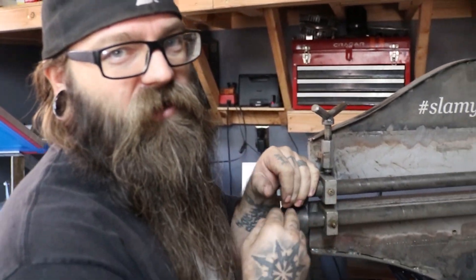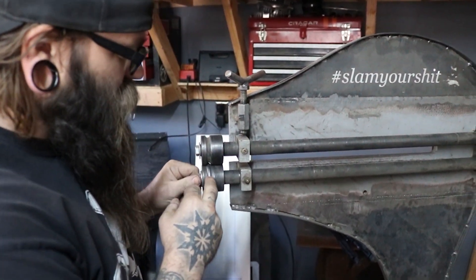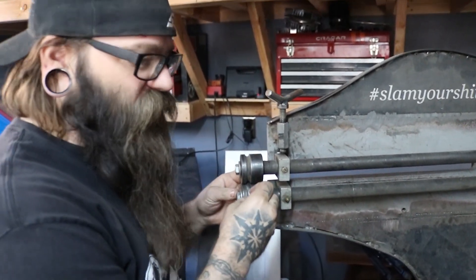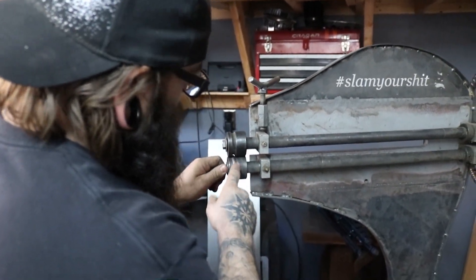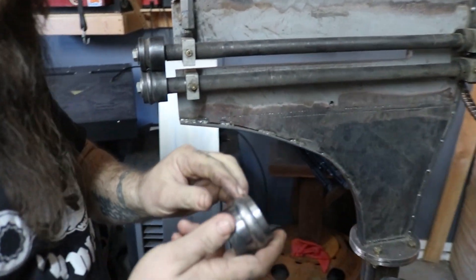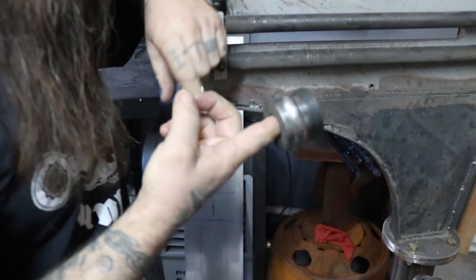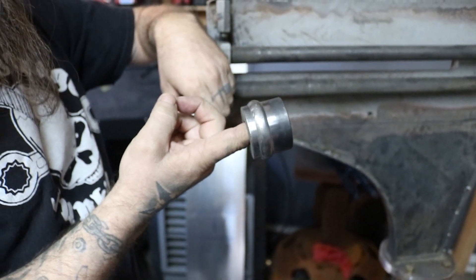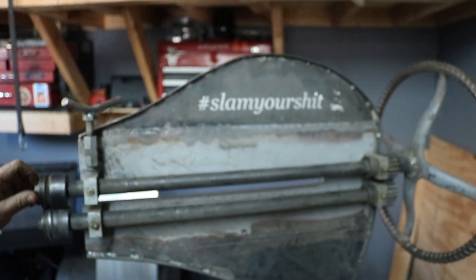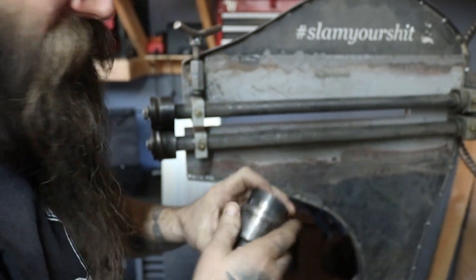I lied when I said I've never used this. I've actually used this to do intercooler piping on a Subaru — I used this to roll the aluminum tube to put an edge on it so you can clamp to it. Anyway, I think this bead is too small and I wish I had a bigger one. Judging by the wear on this one, my guess is Chase used this one a lot on his tubs — that's who I got this from, and that's also where that sticker comes from. I think we're going to switch to the biggest bead because I think that'll look the best.